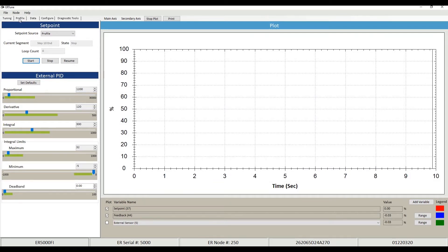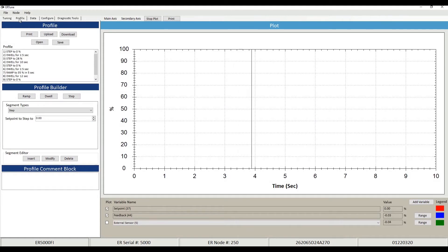It's quite an impressive device for regulating pressure, fluids, or whatever the case may be. Now we're going to open our third test profile, which I've called 'Hysteresis.' Hysteresis is basically what happens when you have a mechanical regulator and you change the pressure set point — say from 25 PSI to 50 PSI. It needs to go there instantaneously, but on a mechanical regulator it'll often fluctuate before actually getting there. It won't be at 50 PSI immediately. Similarly, bringing pressure from 50 PSI down to 15 PSI can cause that same sort of reaction. We call that hysteresis.